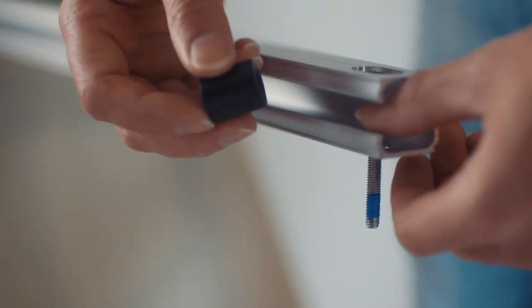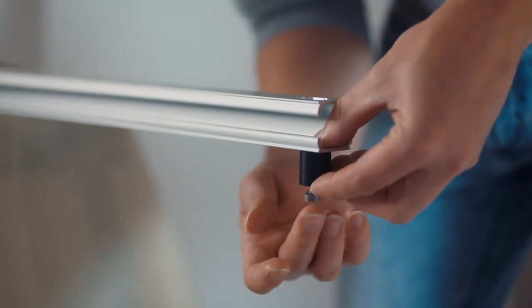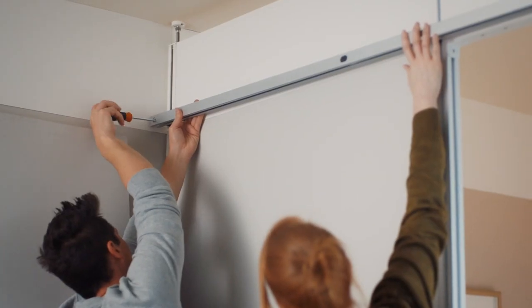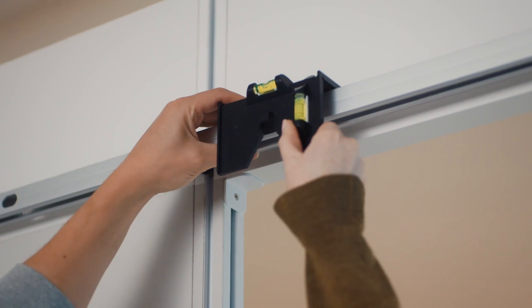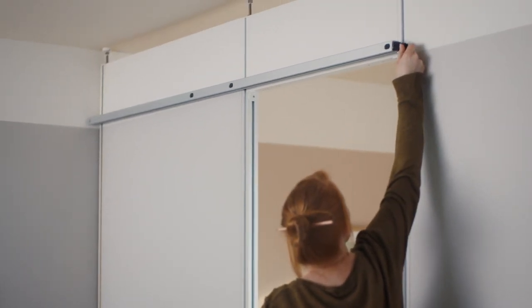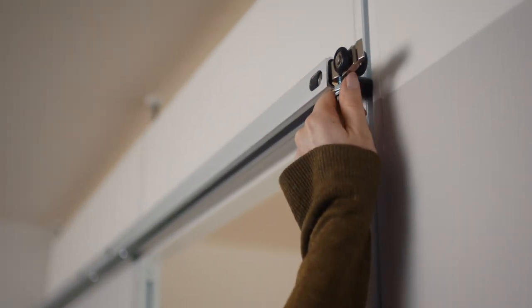Put the screws through the appropriate holes in the rail, add the spacers to the other side, and attach the lugs to the end of the bolts. Your rail is now ready to fit. Position the rail at the marked heights and screw into place, ensuring that the lug gets twisted and doesn't stay vertical when securing the rail to the post. Repeat this at the other two posts. Check that the rail is straight with the spirit level. Slide one stopper followed by the two wheel door attachments onto the rail and add the final stopper.